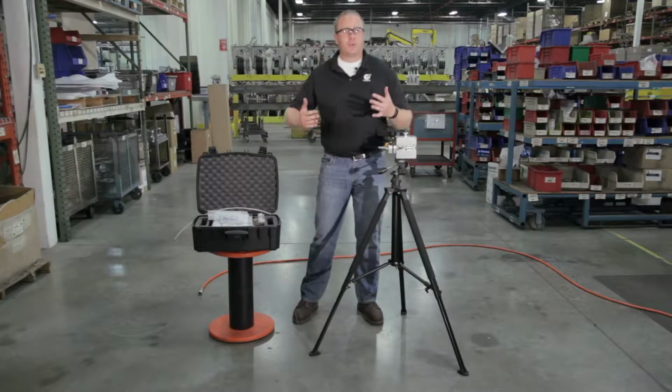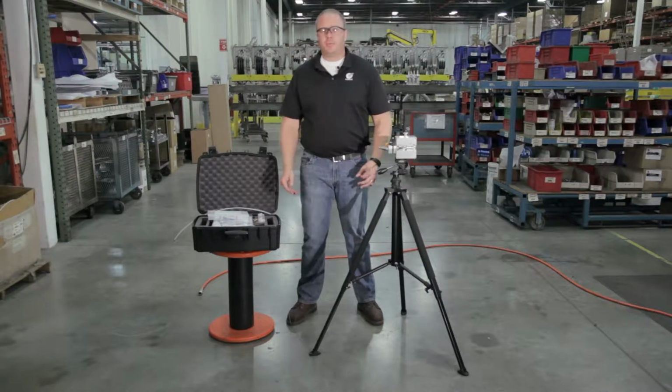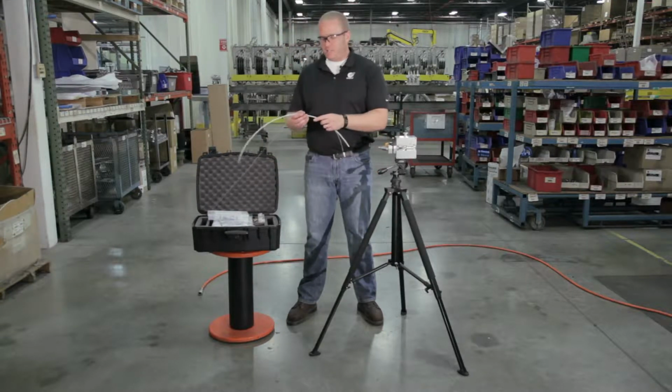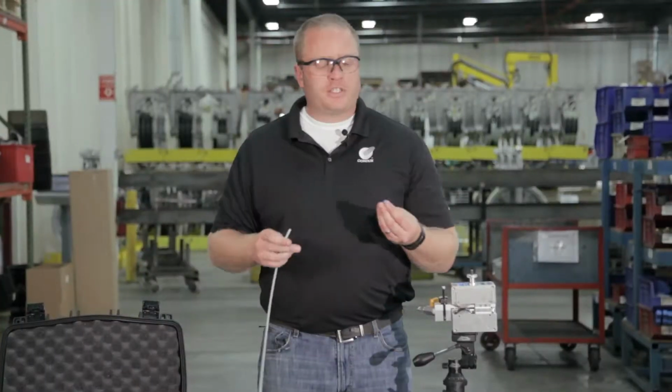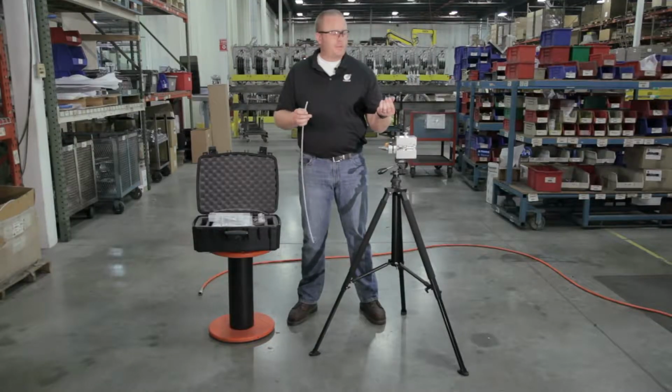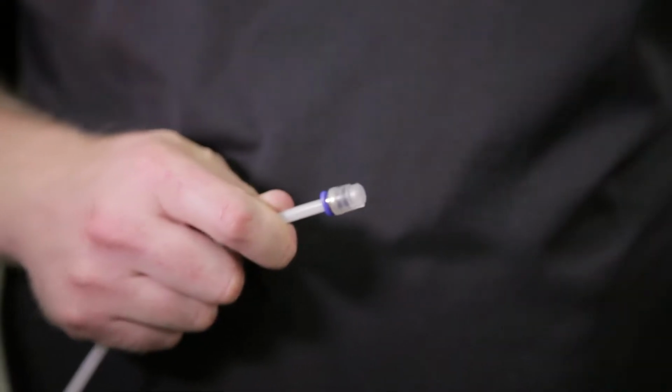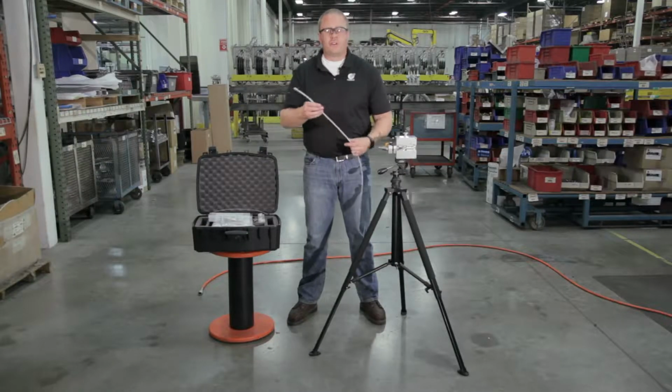Today we're going to be installing 1.1 millimeter into a 5 millimeter duct. So for our crash test, we're going to get a sample piece of that duct and a sample piece of that fiber. So I'm going to want to take our end cap from our 5 millimeter pressure test and proofing kit. I'm going to slide it onto the end of this duct to create that obstruction for our crash test.